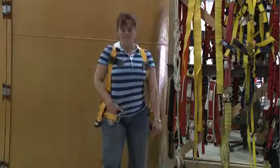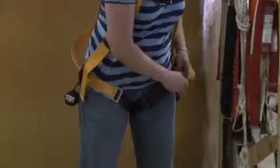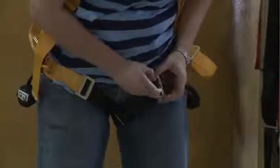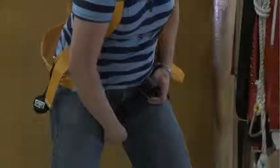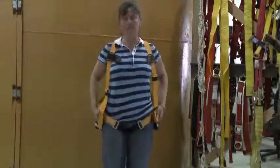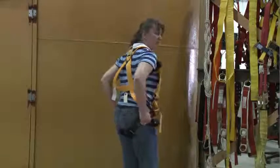We've got one in — four fingers, that's it. Continue to the other side. Same thing: make sure your straps are flat. Bring it around, set it up, buckles in, center up. Some of these are a little more difficult than others or they're uncooperative. The idea is you want to protect yourself — you're not there to just look pretty. Four fingers again. Control the straps. Now you've got the bottom seated in the appropriate place. You want the joints right at your hip joint, this strap up tight under your butt. When you're hanging, this is where your weight's going to be supported from — you don't want it loose.